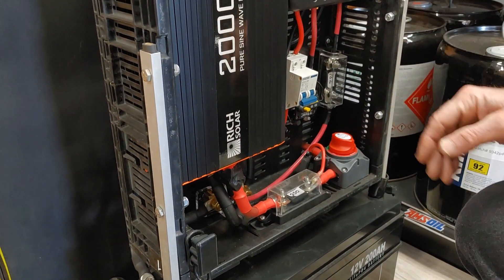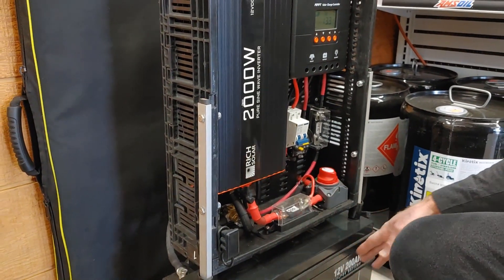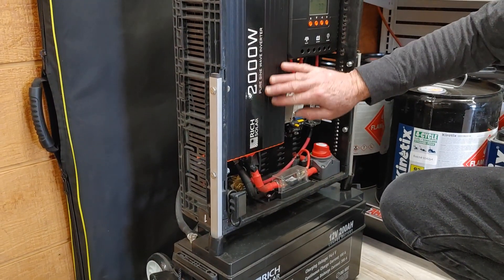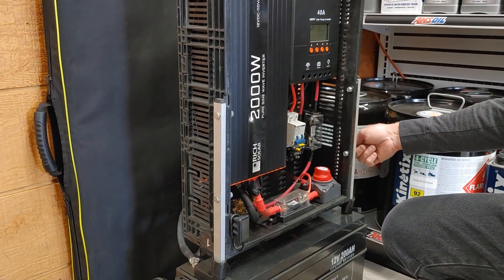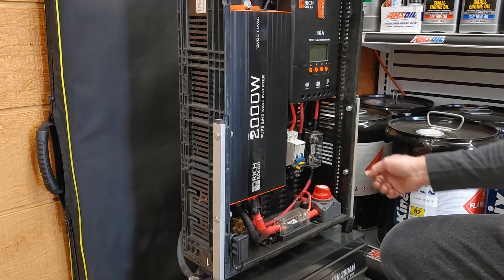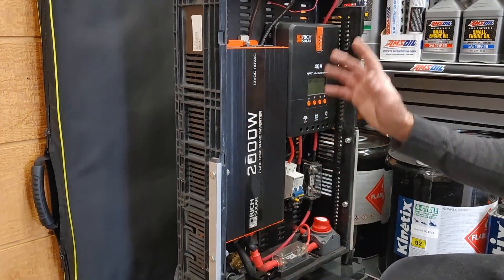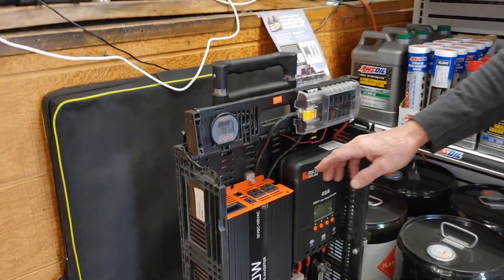What I'm going to do now — I already turned it on. When you turn on this amount of amps, you want to pre-charge the capacitors in here, and I go over that in this video. Some people use a diode; I use a circuit tester just to bring a little bit of power in there. Then I switch it on — it's on already.